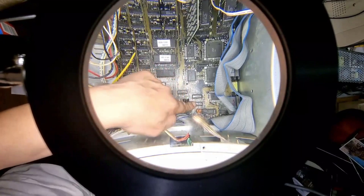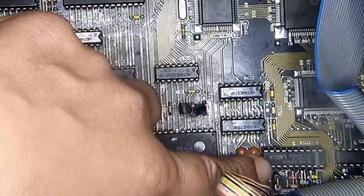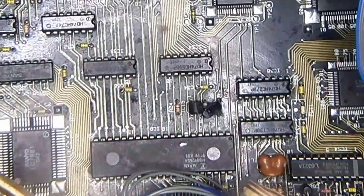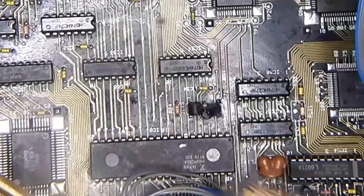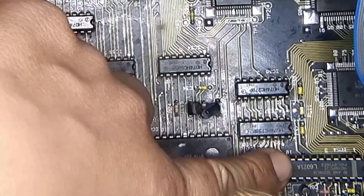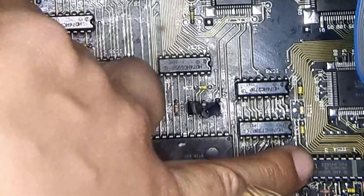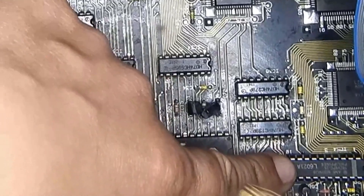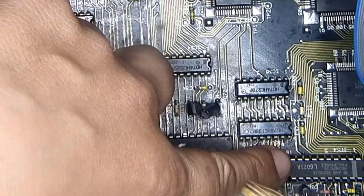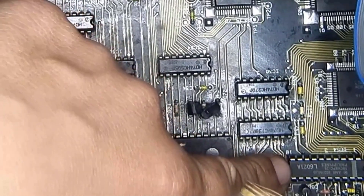The removable IC — now here's what I wanted to tell you. Yesterday I took out the L6021A chip and switched the sampler on just to see what would happen. Guess what — there was absolutely no change. The sound was still sounding duff. So could it be this chip? I found the chip online and ordered it on eBay from China, so it'll take a while to get here. Logic tells me: if you take this chip out and the problem is the same, then that chip isn't doing anything — which means technically it's duff.